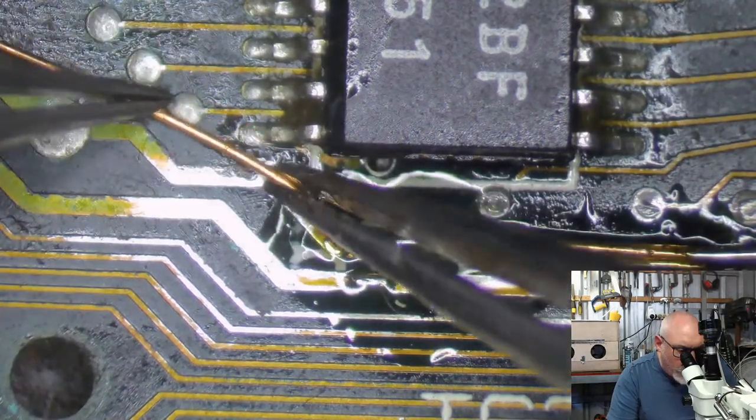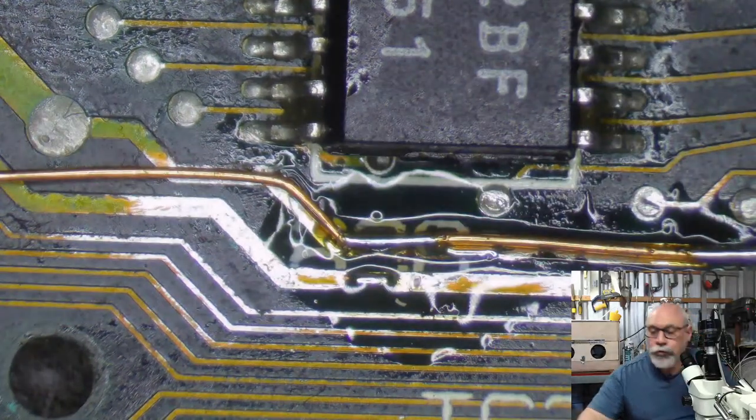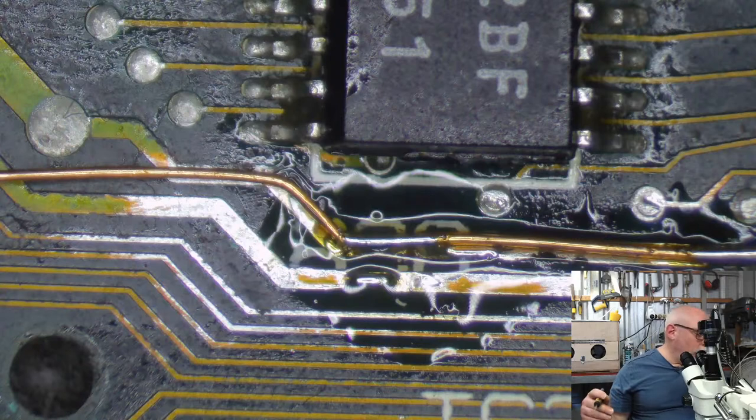Sure, you can absolutely do that. But when it actually comes time to select which one you want, let's just say, for example, you set it up with System 6, System 7.0, 7.1, 7.5, something like that. When you then connect it up to the computer, you don't get to choose which one it's going to boot from. It might boot from System 7.5 on a computer that needs System 6, and it'll just come up and say the system doesn't work on this. You don't have the option to then go in and change it unless you can actually boot from a working system and then select which one you want it to boot from. So you just have to consider that.